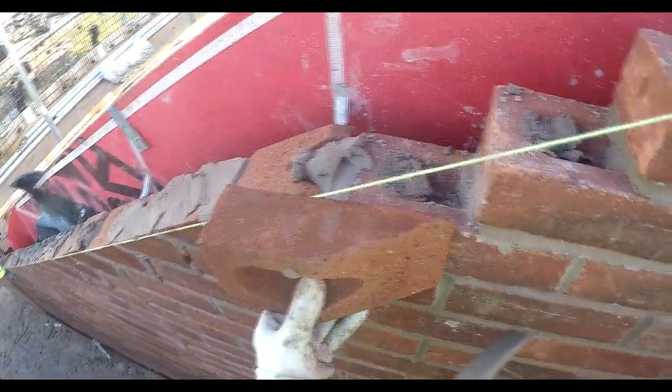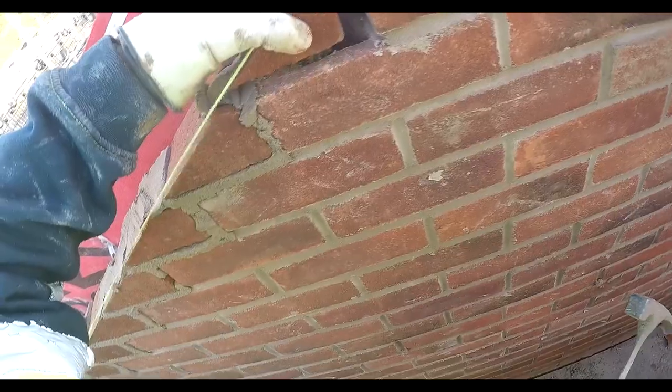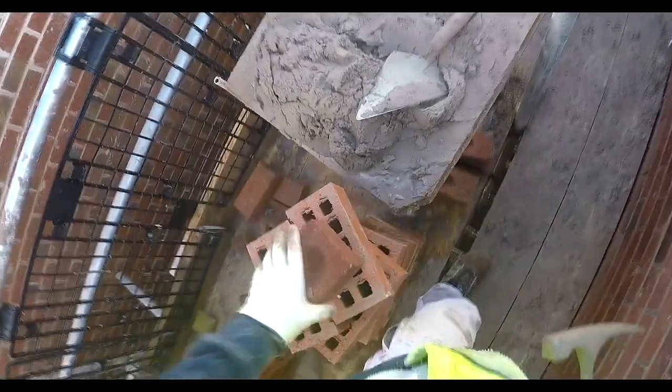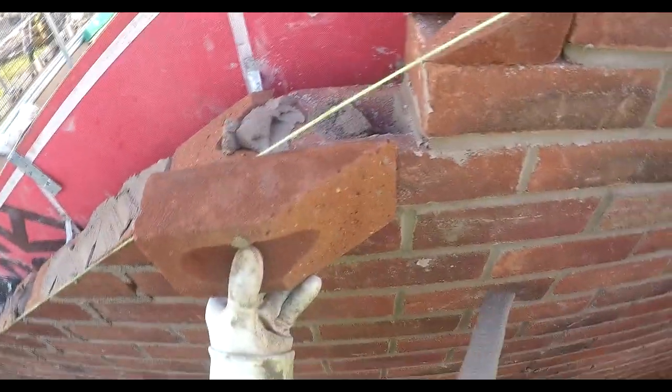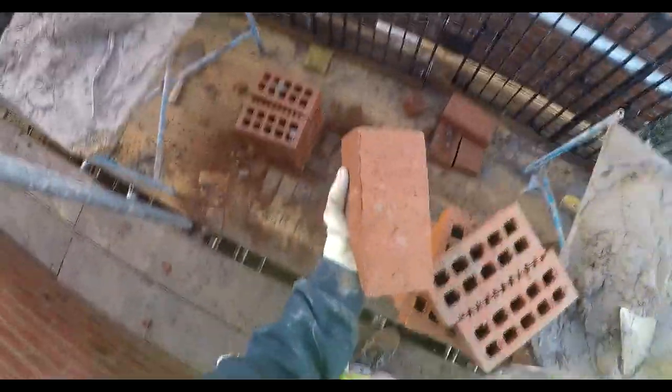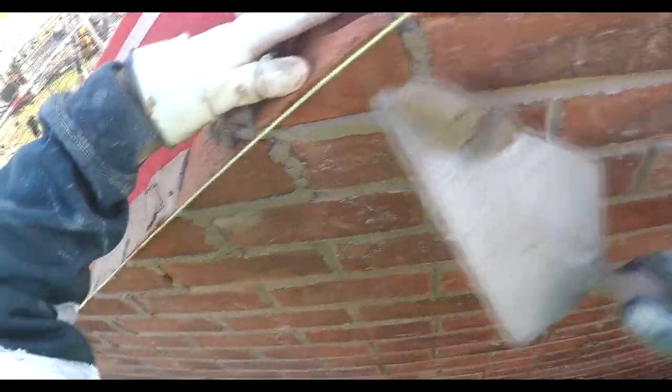It's quite a good way of chopping these bricks — just mark the front and then bash the back. This little cut here, I'm thinking it might go in there but obviously not. It's going to come in on the next one. And that's the offcut. When these bricks go to the factory to be cut, you get one big one and one small one. And then on this 30-degree pitch roof, you end up with four big ones and then two small ones, so it's pretty easy to work out the routine. And then a little one comes in.